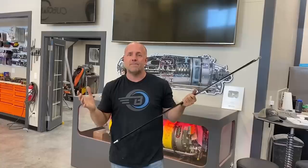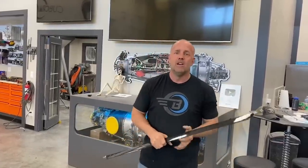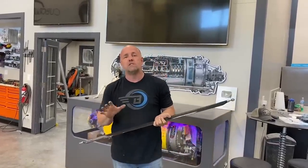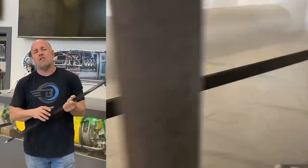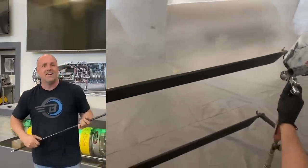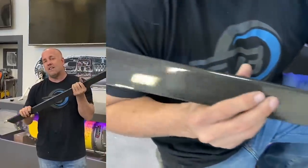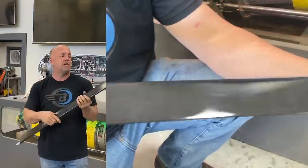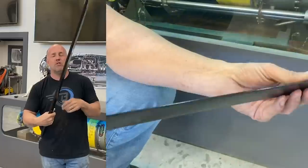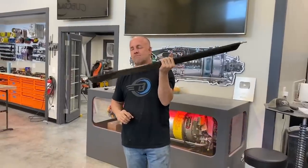Primarily, first, my horizontal and my vertical are so much bigger than a Cub, with so much more load on them, that I wanted to really get a hold of it. And so I really needed to go plus about 50% in strength. As we know now that I've done my pull test and stress test, just over 800 and some odd pounds was the fail point when the wire stretched and couldn't return. And this went to just about 4,000 pounds exactly. Just as it went over 4,000 is when it broke.